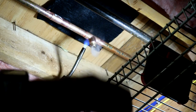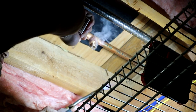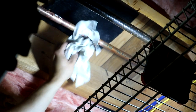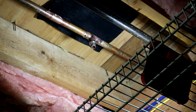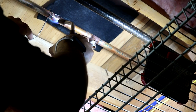You can see all that water steaming out of the fitting — that's perfectly fine. There goes our solder — nice joint. Everything is taking really well so far. What you want to do is get yourself a wipe and wipe it as you go — it gives you a nice clean job. Last fitting we've got is our coupler — looking good.